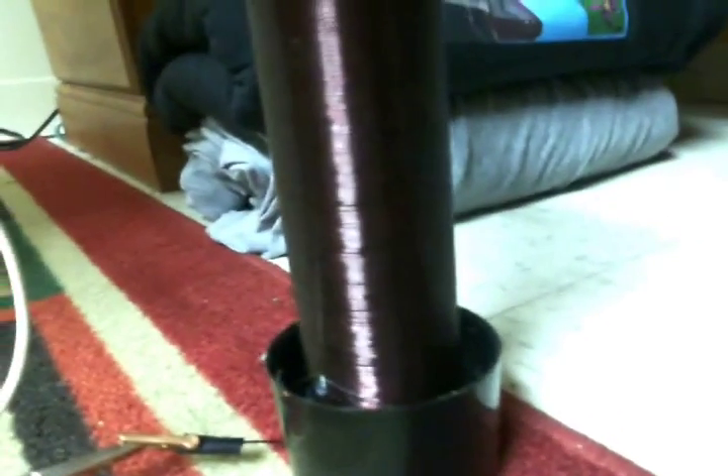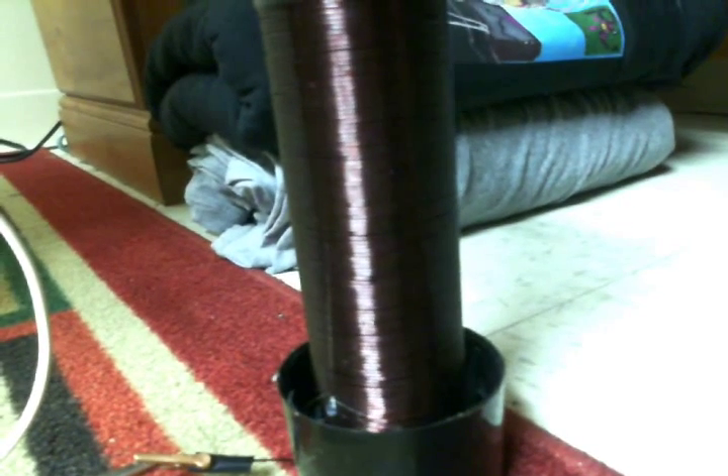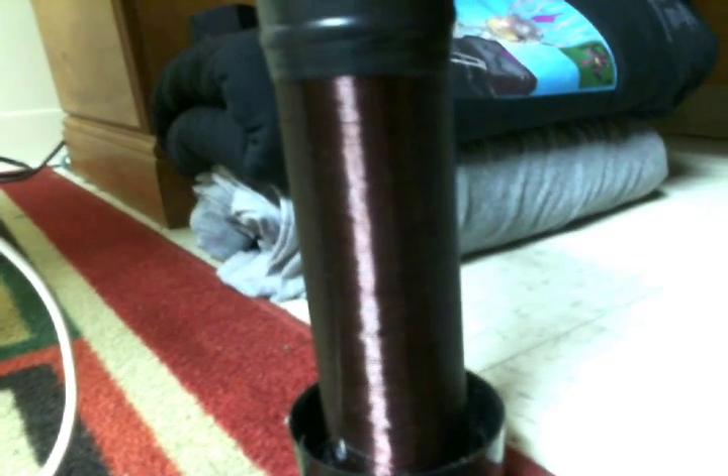What you're looking at right here is a combination coil-capacitor. It started off — I don't remember what gauge the wire is, I just kind of wound it, never did any measurements on that, just testing out something. Anyway, it starts from down here and goes up. It's coil wire and it has a built-in capacitor that is made with aluminum welding wire — TIG wire.